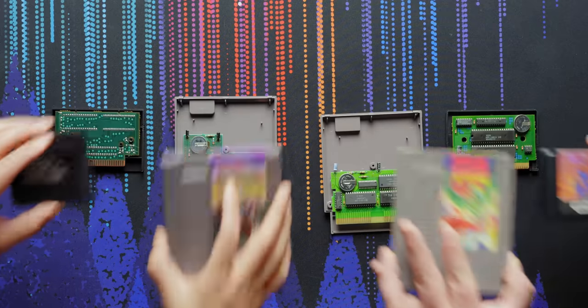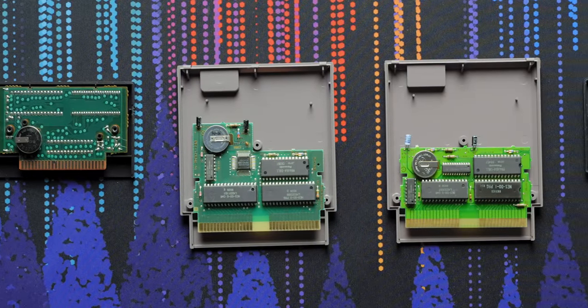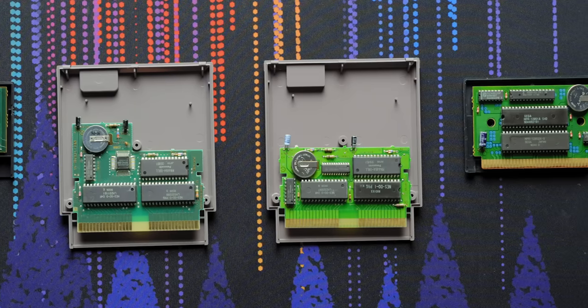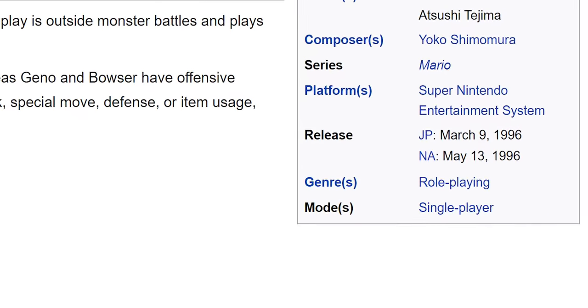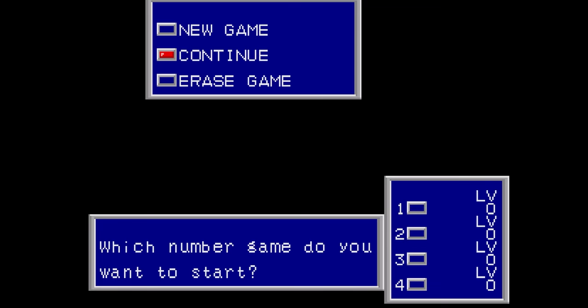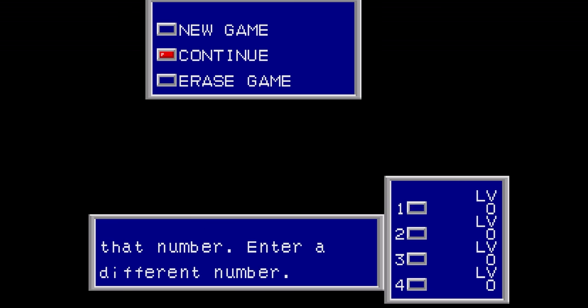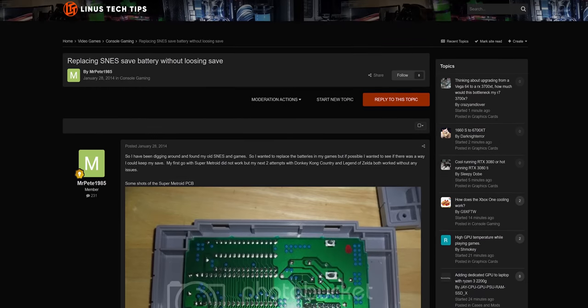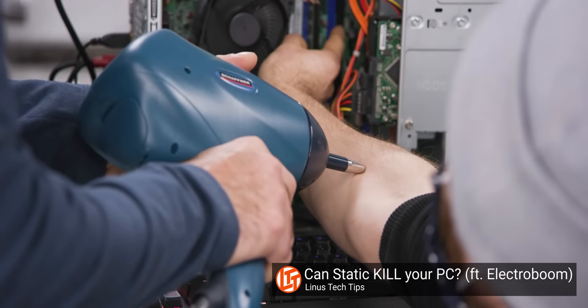And what about your saves? Cartridges from the 16-bit era and earlier almost always used a small amount of battery-backed-up SRAM for saving progress. And those batteries are at least 25 years old now, well past their service life. And once they die, your save games die with them, and you will never be able to save again unless you replace the battery — an act that will erase your save games unless you go out of your way to keep it powered while you solder. Not sure I'd recommend that for novices.